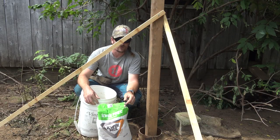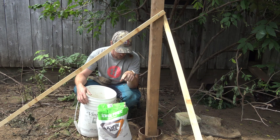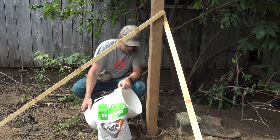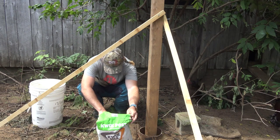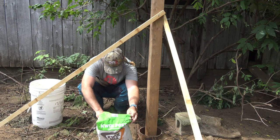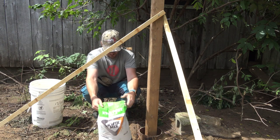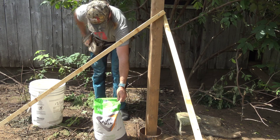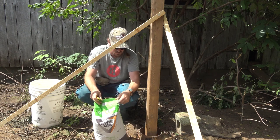This is a product I haven't used before — Quick Post. I thought it was a pre-mix that you'd do in a wheelbarrow and then put in wet, but it's a good thing I read the instructions first, which you should always do. All you do is wet the bottom of the post hole, then pour the dry mix in — add enough to come within four inches of the top of the hole — then pour your water and poke at it with a stick to get the water to penetrate. Let's use my utility knife to cut the cement bag, not my good knife.